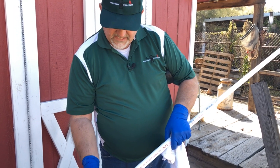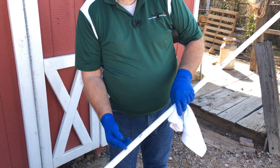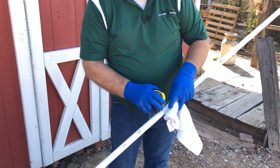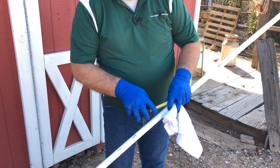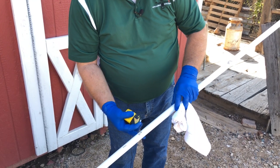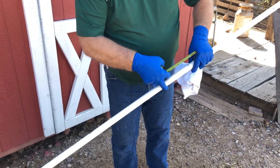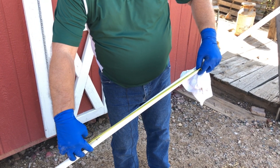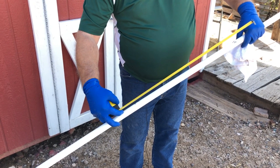Here is the top mark — there's the top of the tank. First I measure the scum level. This is imaginary because it wasn't there, but you would be able to see it. The scum level here is three inches. Then I check for the clear water level, which is between the three and the two mark, and that's 22 inches.